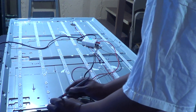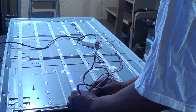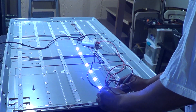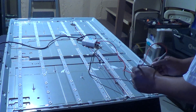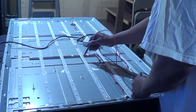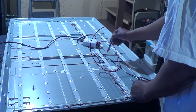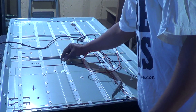I did check each strip. There's one shorted LED on each strip — as you can see, that one right there close to the end, about three from the end, it's not lighting up. And it is like that on each and every strip. So there are 12 strips with 12 LEDs that are shorted, and evidently that's most likely our problem. The shorted ones are right there in the middle where there's no metal underneath to absorb the heat on that particular LED — so that's most likely why. Poor design.